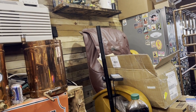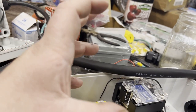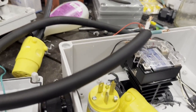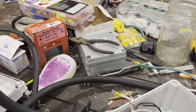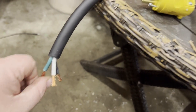I made myself a 240 volt extension cord adapter — on one end I plug the box in, on the other I plug it into the outlet. I'm going to shove the wires through the cable glands and show you how to wire everything up. The way I'm wiring it: power in will be on the left side and power out on the right side.